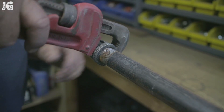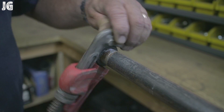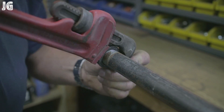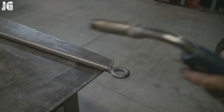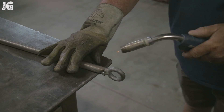This is the three quarter cap I'm screwing on to the end — this will be up at the top. This is what I'm going to use to take my mallet or a three pound sledgehammer and drive it into the ground. It's going to work pretty good. And there's the eye bolt — fits perfectly inside the tubing — and just going to weld that up into position right there.